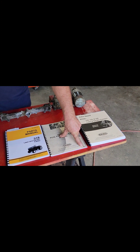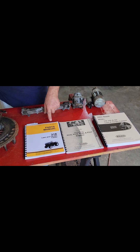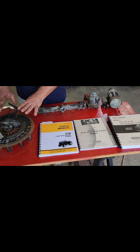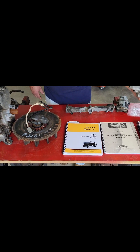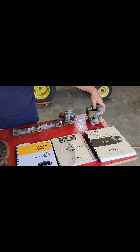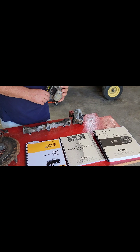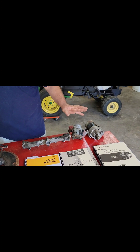We've got the parts manual, the basic service manual, and the technical service manual: SP 216 Plus service manual and the 1924 parts manual — that's super handy. The starter part number is 191194904, 12-volt — that's the right one. If you don't get the right one, you're going to have to shim it or do something weird. If it don't fit, it ain't the right starter.